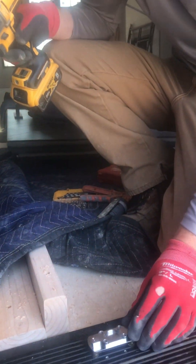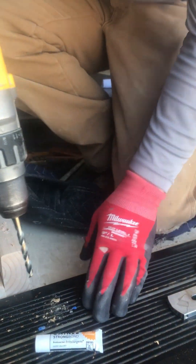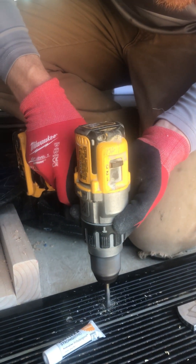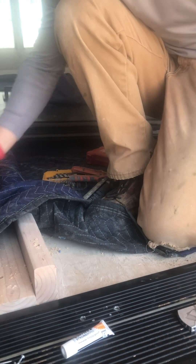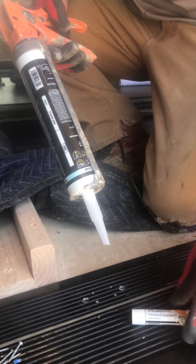So we're going to take those pins — the holes aren't deep enough, so I'm going to go ahead and drill those out. I've got those holes drilled a bit bigger, and we're actually going to tap this down into place. Before we do that, we're going to fill these holes with caulking — we're going to use this glue here.